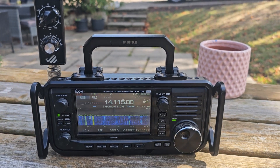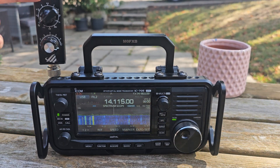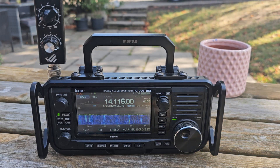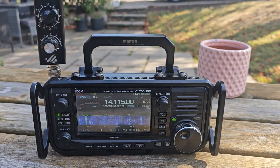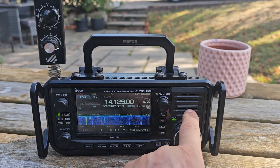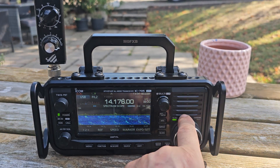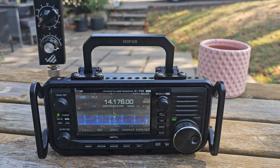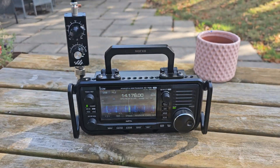I think it's a bit of a toy. If you open this up there's a toroid in there with loops on it. Underneath there's a tuning capacitor — there's no way that's going to handle 20 watts, no way. But as a receive antenna — and if you go out in the garden and want something portable — it works.